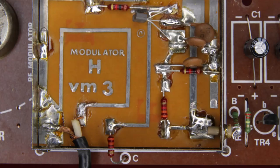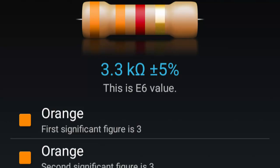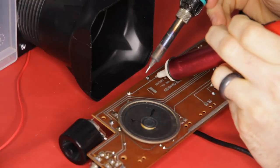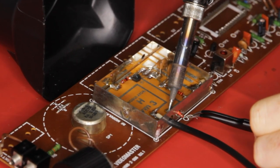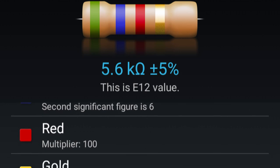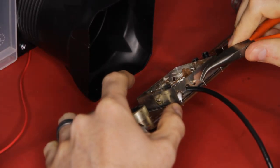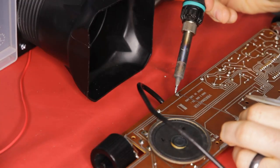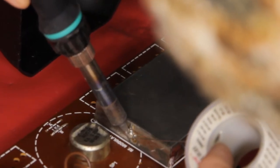I have a thought that the overall brightness is controlled by the resistor bringing the composite signal into the RF modulator. This is a 3.3kohm resistor, which I remove from the board. I try different values and settle on a 5.6kohm resistor to knock the brightness down a bit. Once finished, I solder the lid back onto the RF modulator.